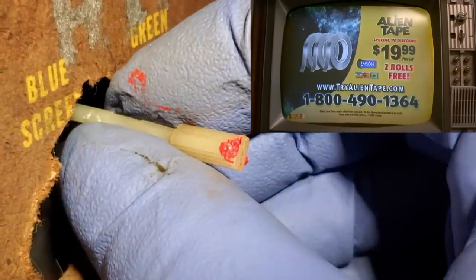This is the issue: bad horizontal lock. Really bad horizontal lock. For the past two or three days, I've had to keep constantly adjusting it. And it's just very, very touchy. The range of rotation on the horizontal hold control has dropped. Going to show the range of lock on the horizontal hold.